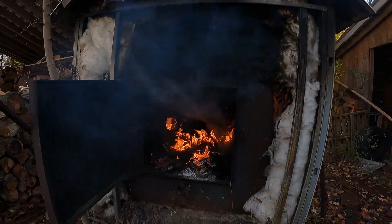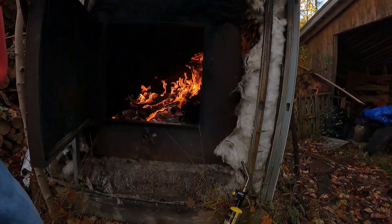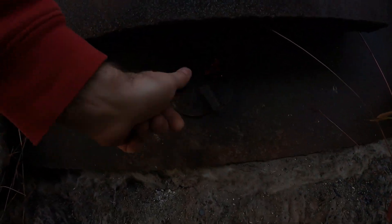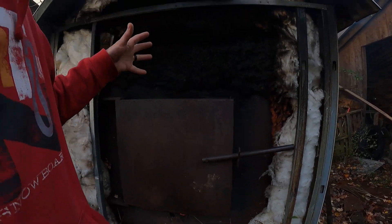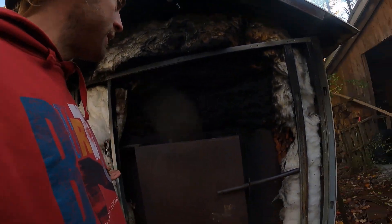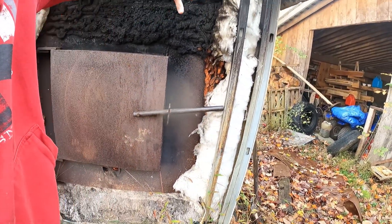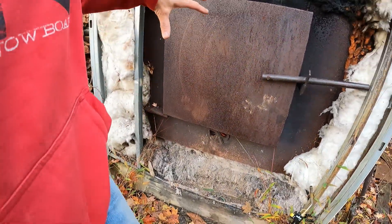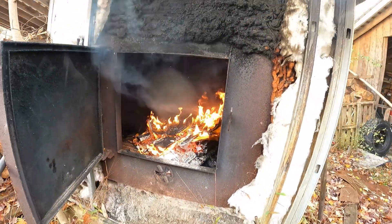I could go on and on about this thing - it's just great. This one has no electricity to it, it's not a power-vented unit. I have draft control right here - this controls my draft if I need more or less air. Where you build the fire in this particular box determines how much heat you really get out of it. If I build it more toward this side where all the plumbing comes through, the water comes in the top and circulates through the whole box, then comes out through the bottom corner. If I have all the coals and fire really on that bottom corner, that sucker will get real hot right before it goes into the house.